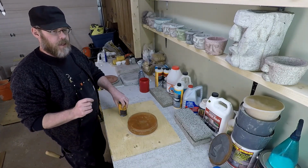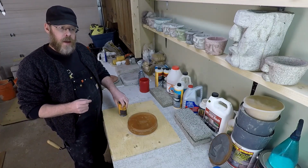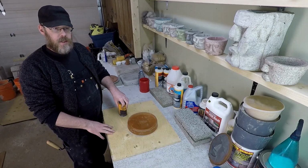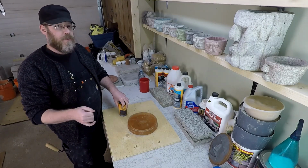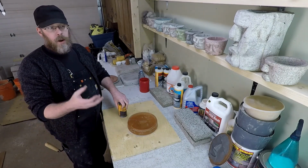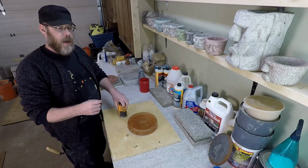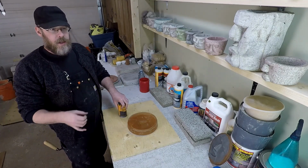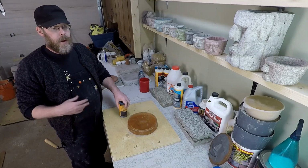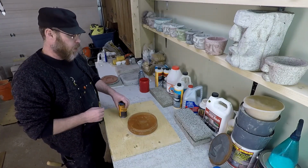And further to that, with a dark gray or a charcoal color to your concrete, it's going to really highlight inconsistencies in it. If there's a scratch or a trowel imperfection from finishing flat work, or if there was too much water raised during finishing or too much calcium in the water that was used or calcium added to the mix, you'll get white striations and concrete burn and all sorts of visual imperfections. So black concrete or dark gray charcoal concrete, it's one of the more challenging ones to work with.